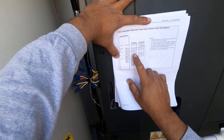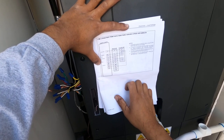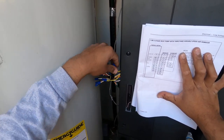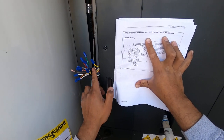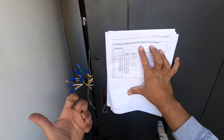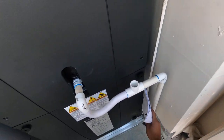Trane does not do that. They want Y-out, which is this black with yellow wire, connected to Y1 of the outdoor unit. So very important to know that that installation part is different. Now that I did it correctly — comfort control to Y1 at the indoor unit, which is there, and then Y-out to the outdoor unit — now it shut off correctly and it's not going to go off on high head pressure. Interesting fact that people who do not install Trane should know.